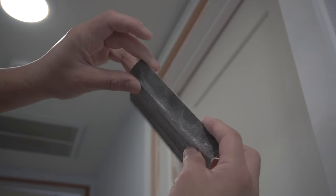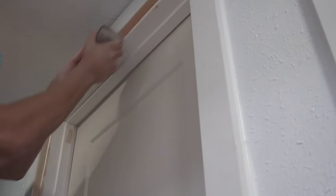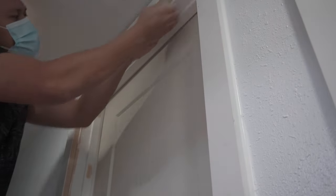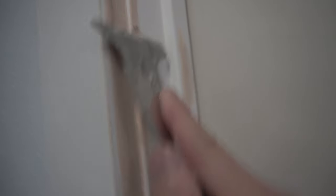You're going to sand off the excess while still maintaining that quarter inch to an eighth inch reveal — make sure you have a good even reveal all the way through. A good trick is to fold the sandpaper in half and place it on a sanding block sponge for a nice firm edge, so when you start sanding you get a nice perfect squared edge. Afterwards, use a 10-in-1 tool to square off the edges and make those sharp corners, and to clean up any excess. A chisel or putty knife works too, but the 10-in-1 does a really nice job on inside corners.